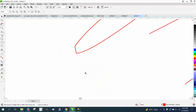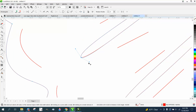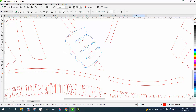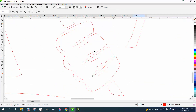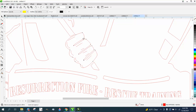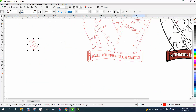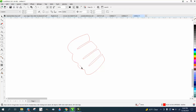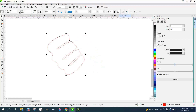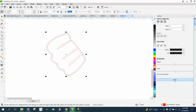Especially in a finger type deal — there are two nodes right there, it doesn't need to be two nodes. We can delete one and use the tool to bring that back in and make it where it's not quite so sharp — same thing on all the fingers. I just realized that if you cut this the knuckles are going to fall out. We need to do something to prevent that. Let's nudge that out of the way and go to Effects > Contour, set it to 0.1, then contour to the outside at 0.1.